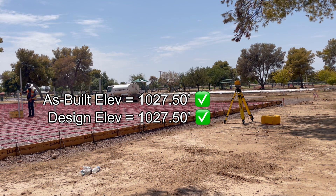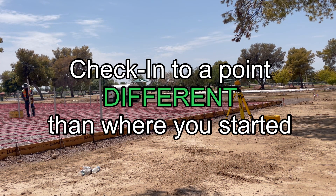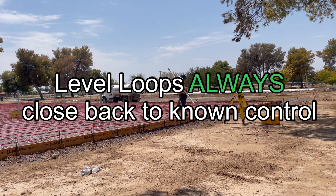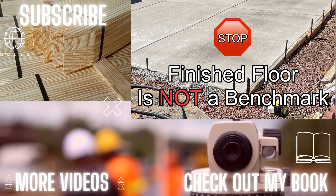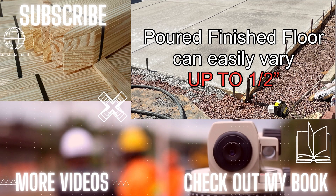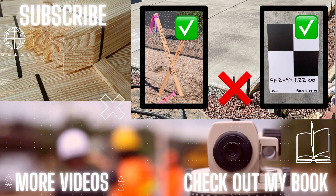We're done with our work, but if we really wanted to ensure there was no error in our computations, we should check into another nearby benchmark or verified as-built elevation. If we have to perform a level loop to transfer elevations around the site, we should always close back into existing control — watch the 'Level Loops Explained' video if you need more insight. Pro tip: remember when our concrete form as-built came out two hundredths low? This is why we never use finished floor concrete as a benchmark — it is irregular, imperfect, and usually unverified. We should always come off a verified benchmark or target card to perform as-builts and quality checks in the field.